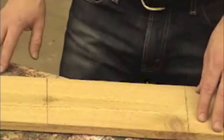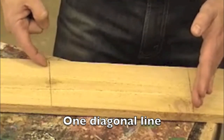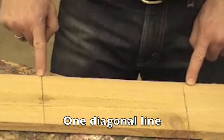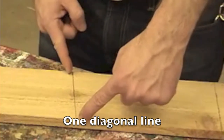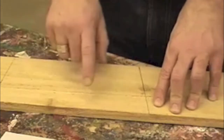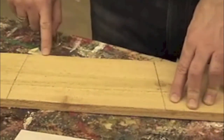When your pieces are marked out, you'll notice that the two side pieces are different because they're separated by a diagonal line. You'll do this by having 9¼ inches on one side and 10¼ inches on the other side — you'll see how one side is longer than the other. That way you'll have a diagonal line. Make sure you measure that out correctly and check your instruction sheet carefully. The long side will be 10¼ inches and the short side 9¼ inches.